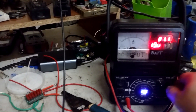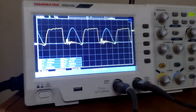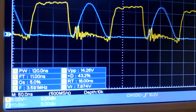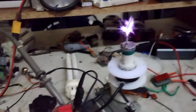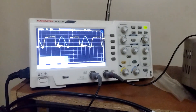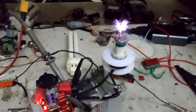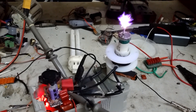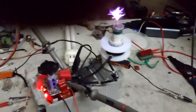Cutting all the way up at 31 volts, pulling about 3 amps. Not bad — that's just how this is tuned at the moment. It's a fairly stiff square wave drive at almost 3.6 megahertz. With the 5k pot I can vary that frequency around, and it's fairly similar to the PLL setup I had going. Pretty cool, I like how that runs.